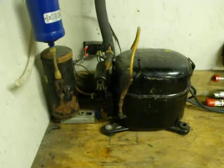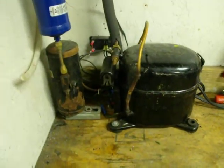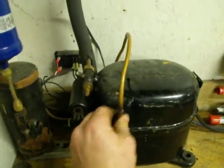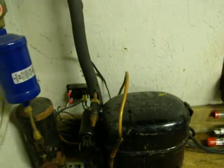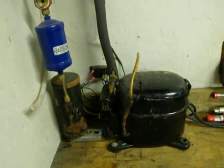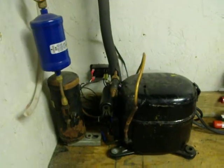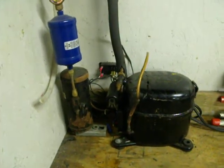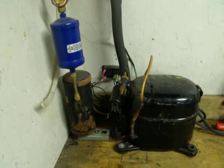This is somewhere near a one-third horsepower compressor. I hooked it up so that this is the discharge line right here — it actually goes down and outside to a heat exchanger with the hot tub water, and then it returns back as a liquid to this liquid receiver at about 102 to 105 degrees, anywhere in that range.